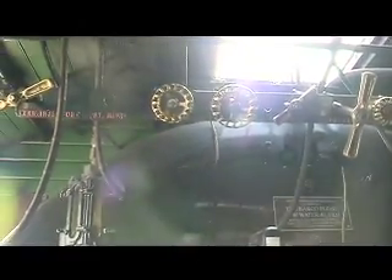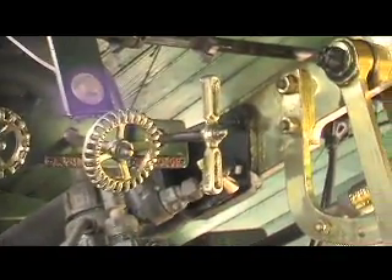Of course, this up here was the water glass again. And then all these brass hand wheels and handles are basically different accessories that run off of steam. There's a big manifold up on top of the engine, right up in front here, and we can turn all these things on — pick which one we want on or off.